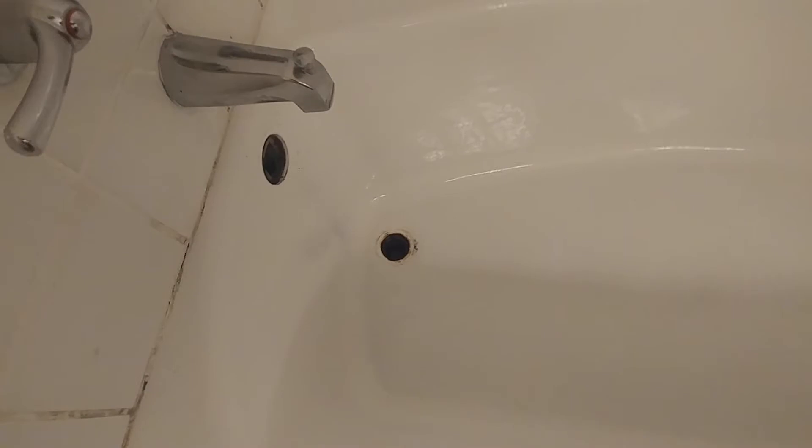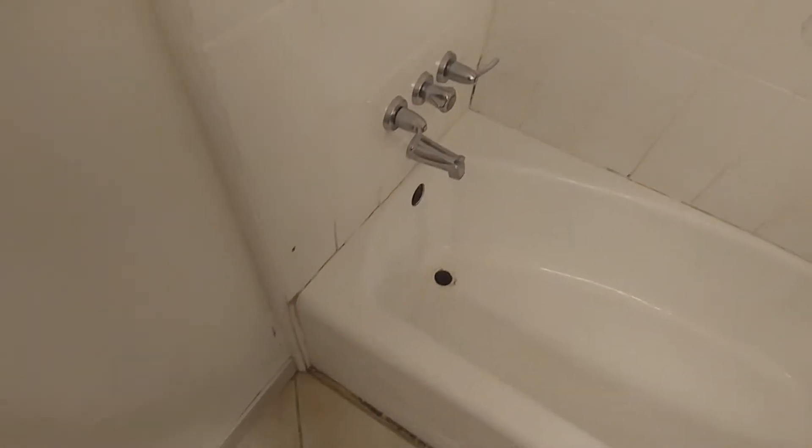Yes, it's the same tub. This is after the first clean — sanded everything down, got everything nice and clean. The tub looks like it's been acid washed before because there are a few spots where it feels a little rough. I think they may have done that when they put the liner in so the tar silicone would stick to the tub. It's wet right now so you see a little shine, but once it dries out there's not much shine to it — even down the side. So this was acid washed before. On to the second clean — make sure the walls are nice and clean, fix the grout lines. I'll show you how we do that without using grout or caulking.